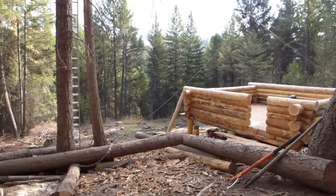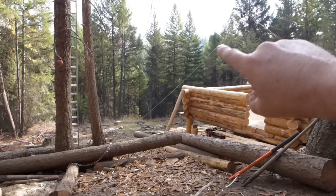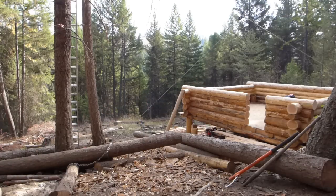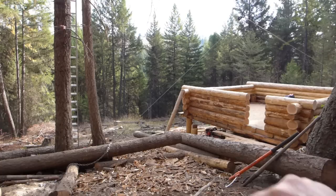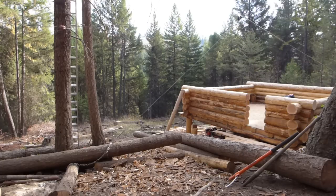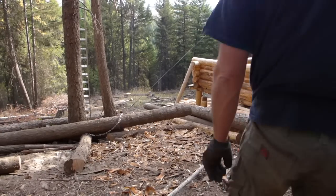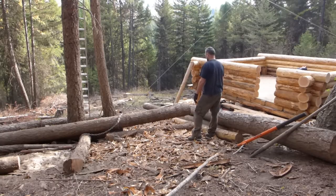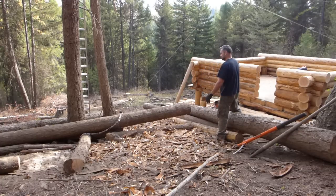Final pull to get these logs closer to the cabin. This one now is hooked up to the cable pulley I have up in the air, onto a snatch block. We're going to give it a pull and manhandle it over this log, and then perhaps bring the butt end up here. We need to be careful — we've done this a couple of times and I've lost control of the log and almost sent it smashing into the underside of the cabin and hitting the pier over there. So we do this in small increments. These logs are heavy, so nice and slowly to keep it under control.